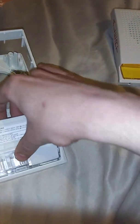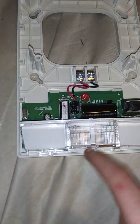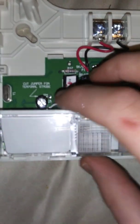But however, there's a little deviation right there. I'm pretty sure there is a little deviation right there, since the ABCD should only be for amber lenses. Since the amber lens has the candela outputs degraded by 10%ish at the higher settings, while 15 candela, if it had the amber lens, it would have a 2% degrade, so it would be at 13 candela, from what I read on my G4WAS2VMA's manual.